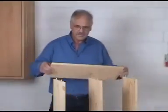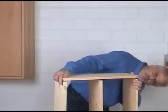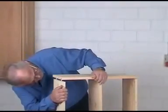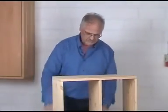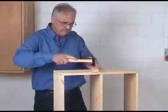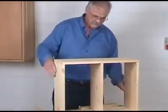If all dowel holes are drilled, then the whole shelf can be stuck together without glue so that the connections can be checked. Later, a little bit of wood glue is put in the dowel holes and on the wood edges. The whole workpiece is fixed with clamps for 1 to 2 hours until the glue has set.